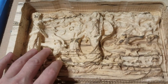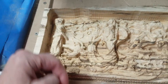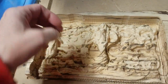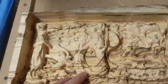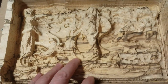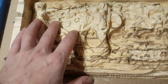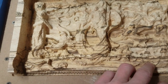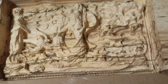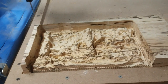Result of our first finish pass with the 1/8. Okay. A really long 1/8. I guess that's as good as you can get with a square-edge bit. So we're going to switch to the ball nose, itty bitty one, which says that it's going to be either 12 or 16 hours to cut. So I'll see if I can speed it up a little bit.